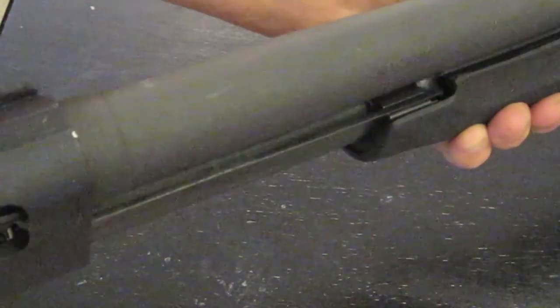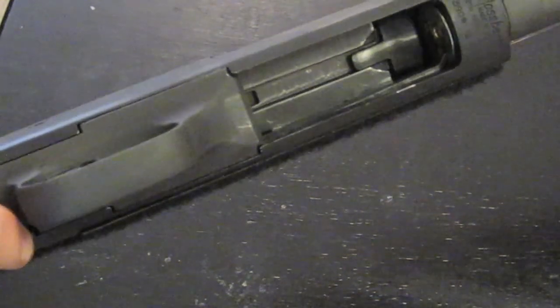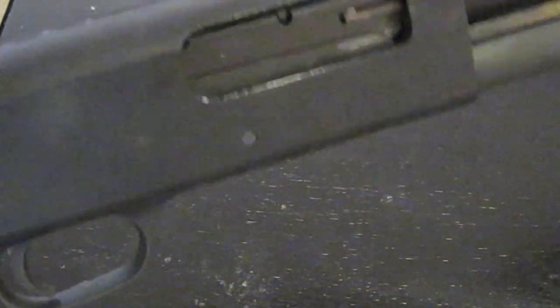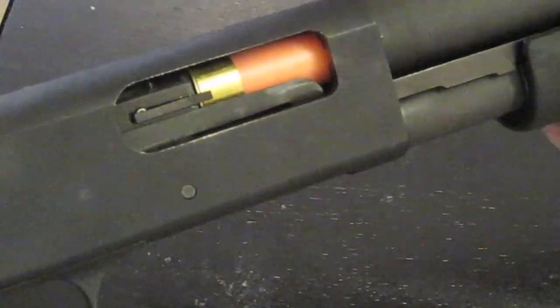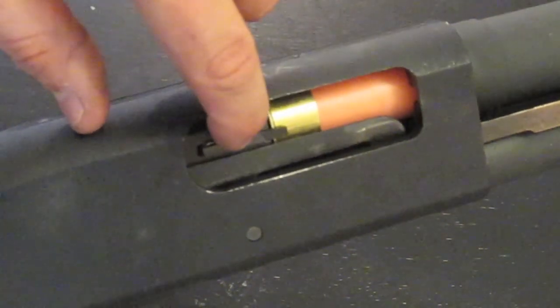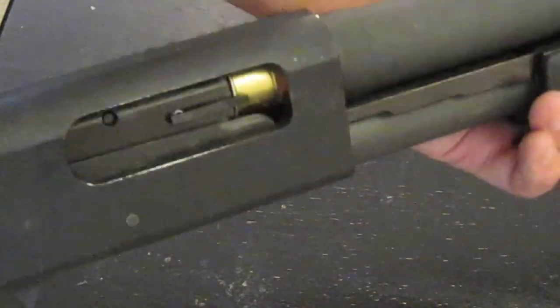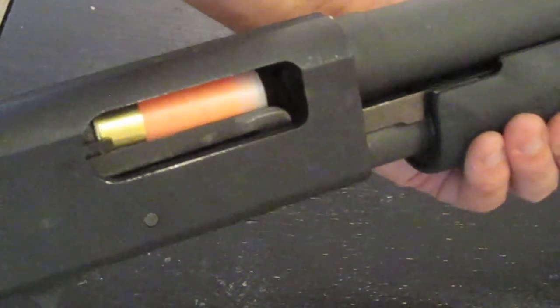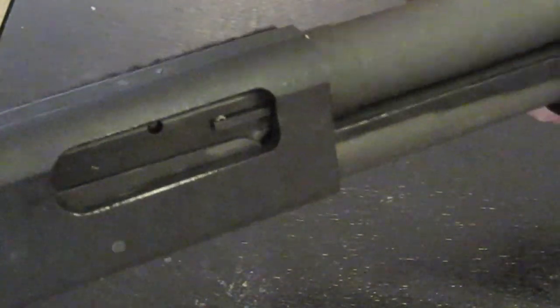Now you notice that the forend and the action is now locked in the weapon. That little lever which comes behind here will allow you to depress. You depress that lever, and now it allows you to manually cycle the gun. Now the bolt has dual extractors on here which grab the round from the chamber. Once it fires, it grabs the round from the chamber. Once it reaches all the way to the end, it ejects it. New round comes in, out, ejects it, all done.